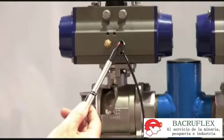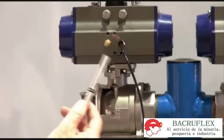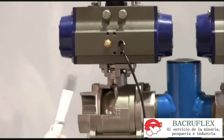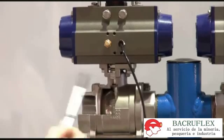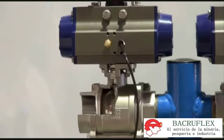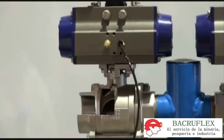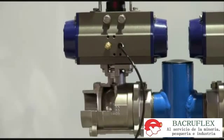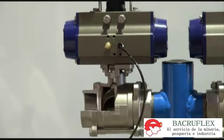Air signal in, and when the air signal is released the springs will rotate it back to its closed or open position, depending on how it's interfaced. To demonstrate: put the air signal in and the valve will rotate. Take the air signal away and it rotates back to its sprung position — open or closed depending on which way you've operated it.